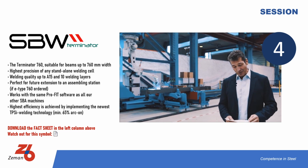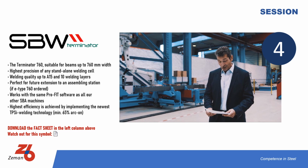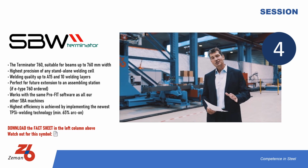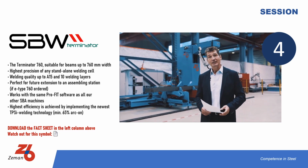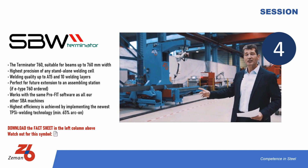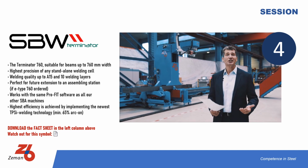So there are again some questions which have been asked from many people in the world. May I just refer to this question from Logan from Canada. So what are the advantages of the machine compared to manual welding? Of course, it's a consistent welding quality and it's a far longer arc on time. So that means usually we say 25% of the time of the working hours is the real welding time of a manual welder. But on this beauty here, you can run 65% of its capacity of the working time is the arc on time. Just imagine you have a welding pack here of 250 kilos. And usually a manual welder has a roll of maximum 10 to 20 kilos of solid welding wire. Here you use 250, so that means there is no constant exchange of the welding drum.